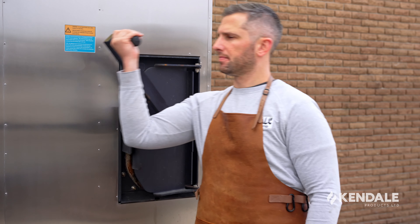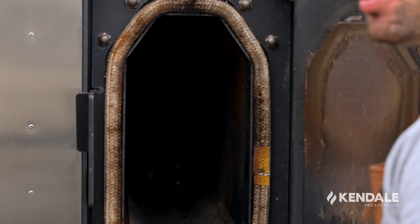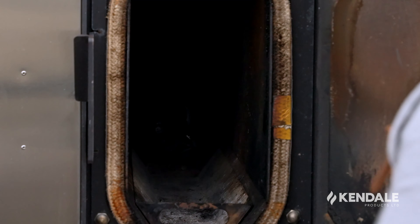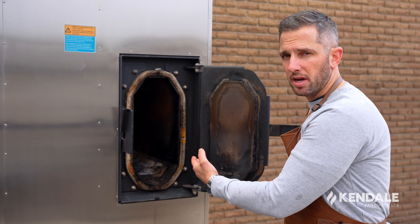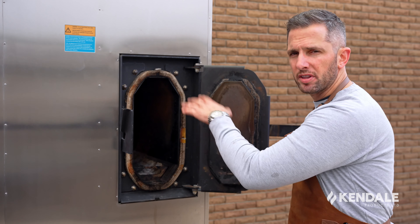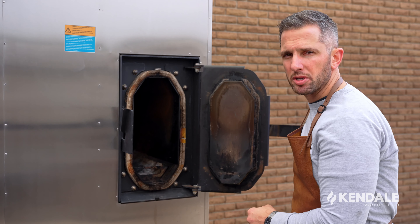All of those steps can be seen and heard through the firebox here. When troubleshooting a burner, I always want you to start by listening and hearing inside the firebox. If you can't gather enough evidence in this process, then we can go to removing the service panel and inspecting the components more specifically.